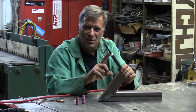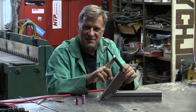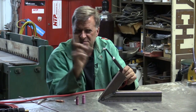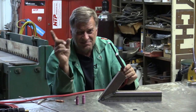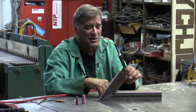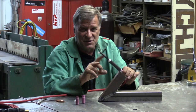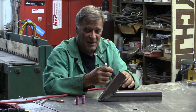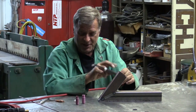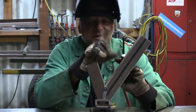Now this is gas cooled, so it's good up to about 70 amps. Or you can get the water cooled, which is good up to like 120, 130, something like that, so you can really push some power through it. It really, really saves your neck when you want to get down to some tight little place. So let me hook it up real quick, and we'll just light it up, and I'll just weld that little joint for you. This is the MicroTorch.